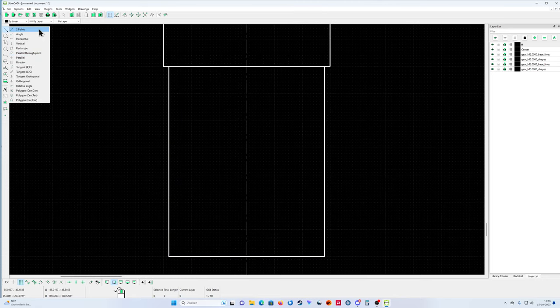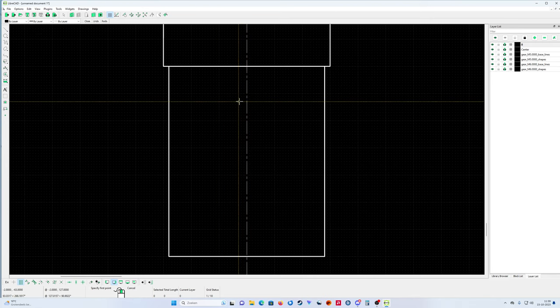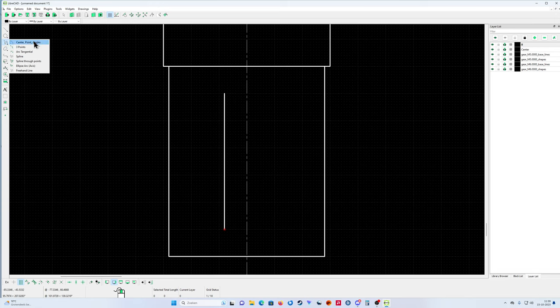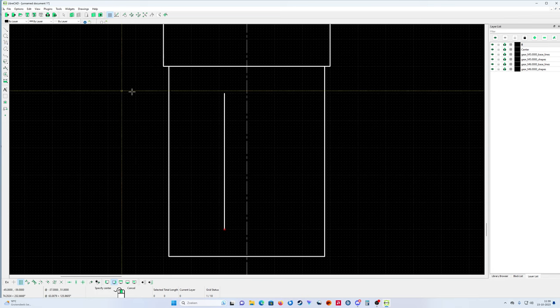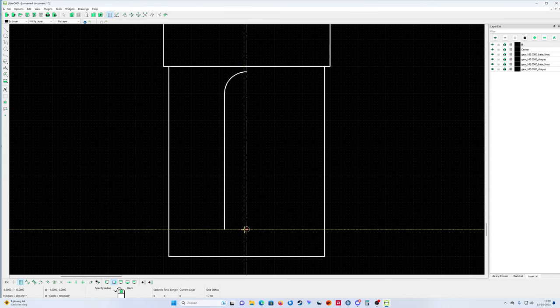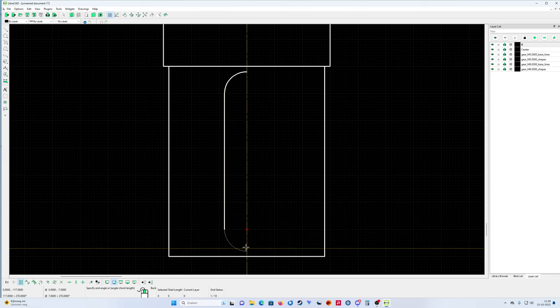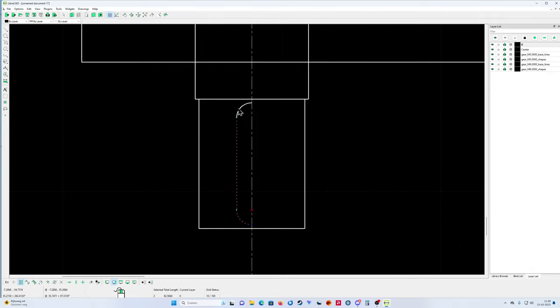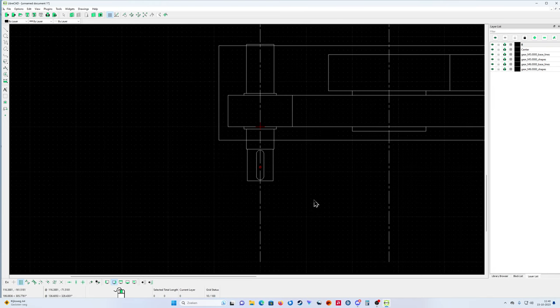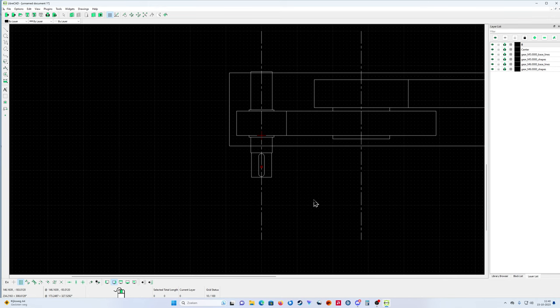What I'm going to do is put a line here, 2 points. 1, 2, 3, 4, 5, 6, 7, 8, from here 8 to here 8. And now I'm going to use center point angle. I'll show you. You click the middle, go to here, and you see where the line becomes longer, that's the direction. Do it here again, click on it, go in the right direction to the middle and finish here. Select it, mirror, and here. A perfect lock, keyway they call it also. That's my input shaft. Nearly finished.